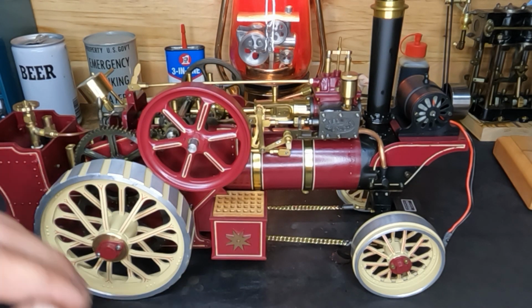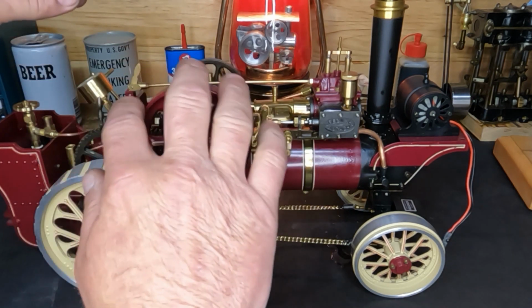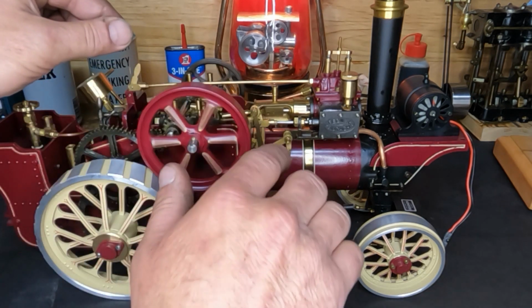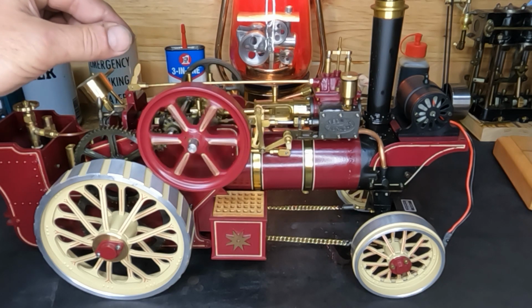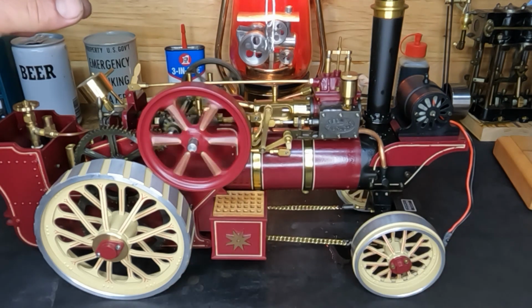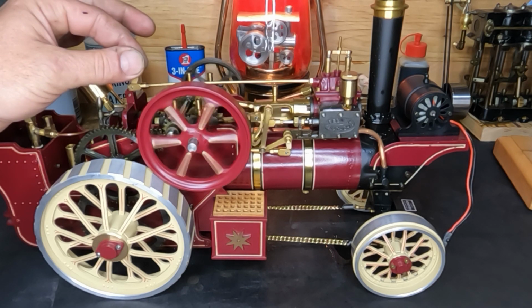I got nothing yet. We are starting to show some steam pressure on our clock back here. It's showing 1 bar, so what is that, 15 pounds? It's trying already. And we've got our throttle closed. There. Guys, look at that. Oh, isn't that neat? I bet you we fix that leak, it'll run a whole lot better. Yeah, this is the throttle valve closed. Let's give it a little bit of throttle. It's wanting to go.